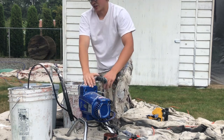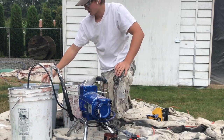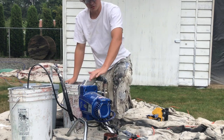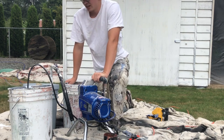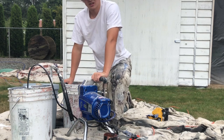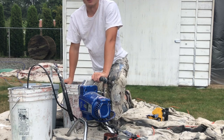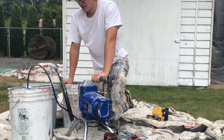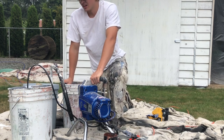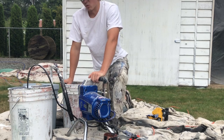You can see the color has changed to the brown color I'm going to be using on the building behind me. What you want to do is keep the sprayer always filled with some sort of liquid, whether it be water or paint, and cycle the next liquid through. For example, when you buy it, it'll have an anti-freezing liquid in it, and when you want to store it for the winter you want to put that back in, but if you're using it regularly you can leave water in it.